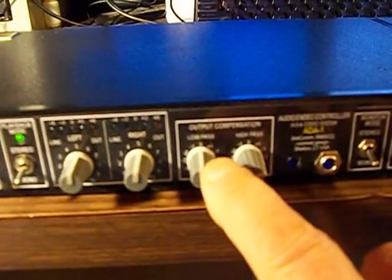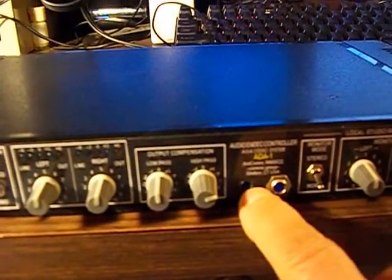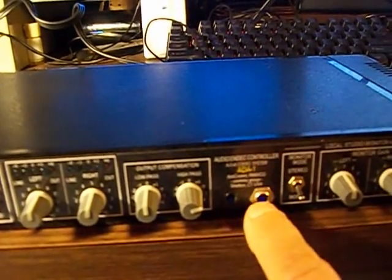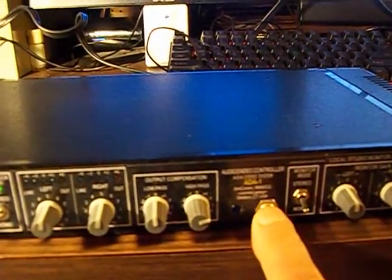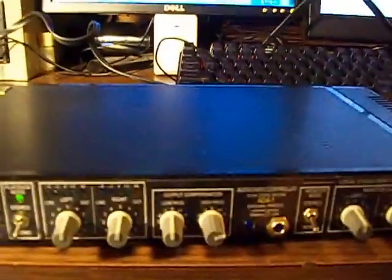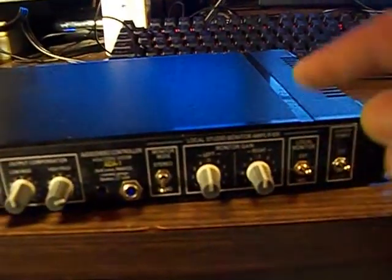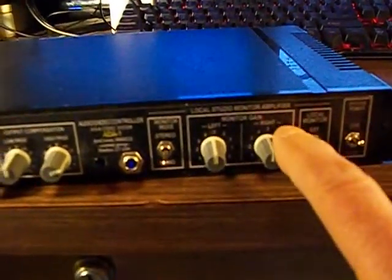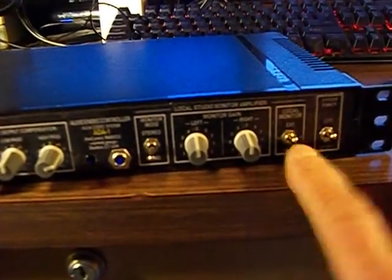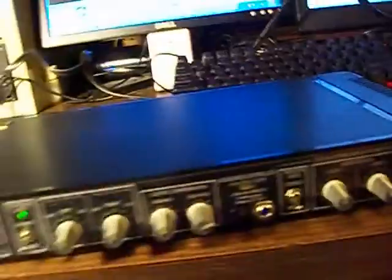Playback line out left and right. We also provided bass and treble both pass — high-pass and low-pass filters. Monitoring phone jack, mini phone jack, quarter-inch phone jack — these are TRS ring-tip-and-sleeve type. Two little power amps so we can play some audio out of the speaker jack in the back. Internal/external loudspeakers — that function isn't finished, and I want to put some little monitor speakers in the cabinet here. And the power switch.